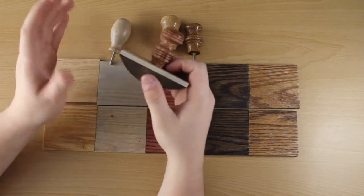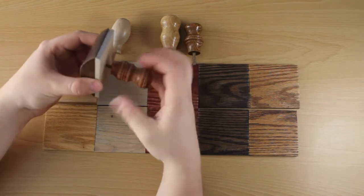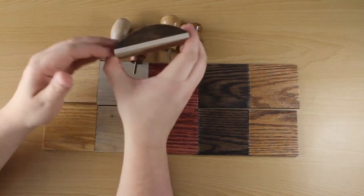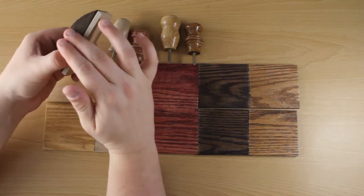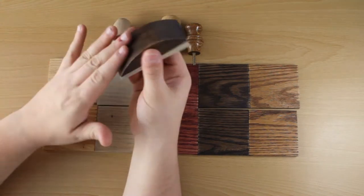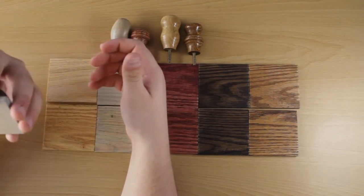But if we had to make a stock of each individual combination, they just wouldn't get purchased like we would like. So they are made to order as soon as you place the order. I'll go out and start finishing. It does take about 4 or 5 days to actually do once you start staining it, to allow the stain to dry, and then the finish options, and then sanding it down and finishing again just to make sure it is as smooth as possible and at the quality level that we like.